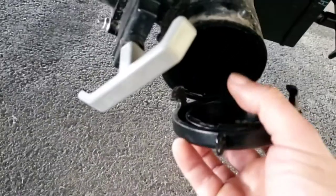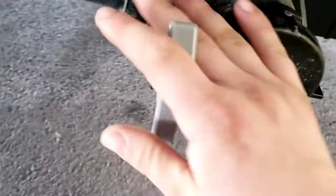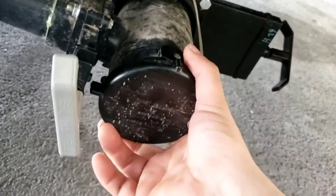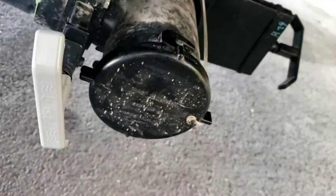The sewer is out here. Your gray handle is your gray tank — that's your shower and sink water. Your black tank is your toilet water. Always make sure these are all the way closed before taking the cap off. Dump black tank first, get your hose hooked up, let it empty completely, then dump gray tank. That flushes out the hose so you don't have black tank residue drip on you when you move the hose.